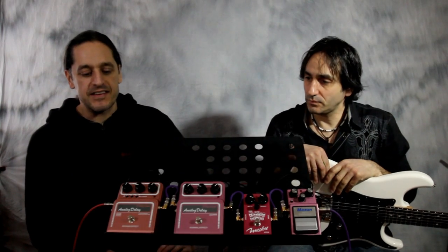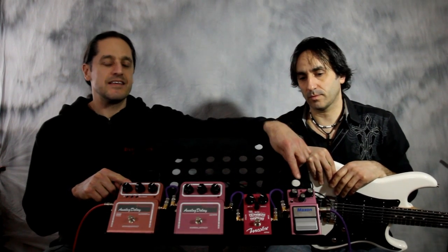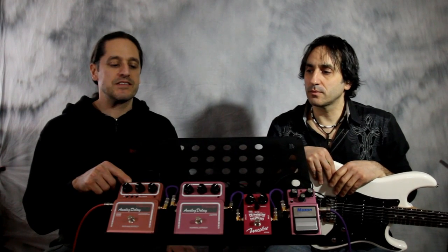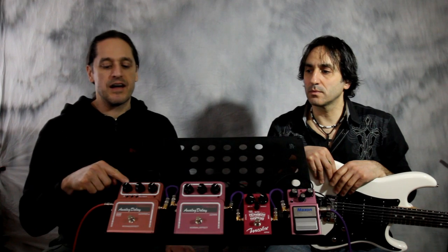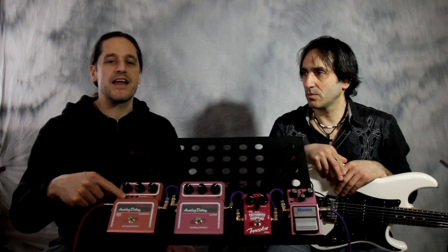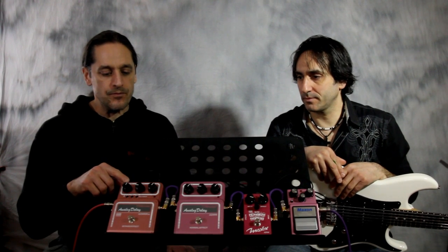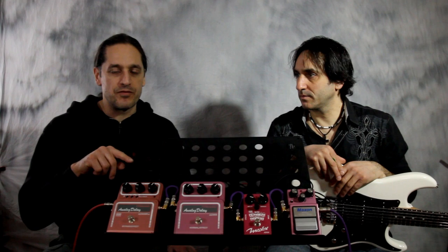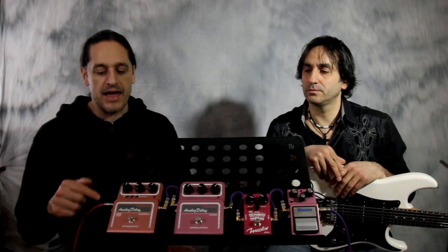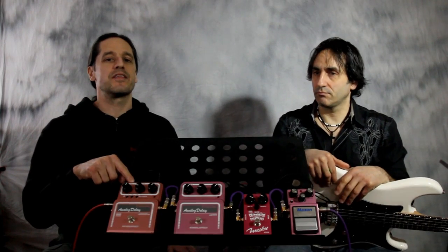The AD-999 Pro came out a couple of years after the AD-999, and the AD-999 Pro and AD-9 Pro use very similar circuits with the same noise filtering on delay repeats. This one is 900 milliseconds — double the delay time of the AD-9 Pro. It has three multi-tap switches at 3/8, 4/8, and 5/8 beat splits, which you can use in any combination to get polyrhythmic delay repeats. The repeats have very pristine, flat frequency response — a little rounder than the AD-999, not as bright, and not as distorted. It has mechanical true bypass switching, dual wet/dry outputs, and also runs at a higher voltage for effects loop use.